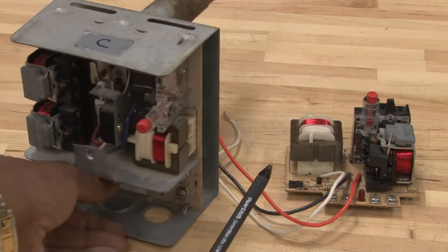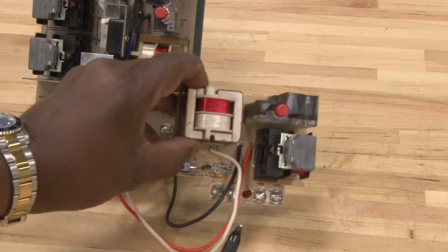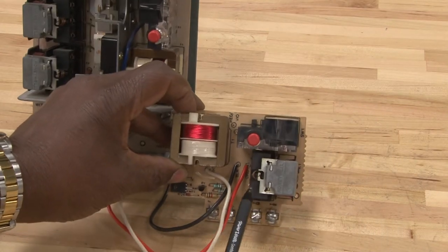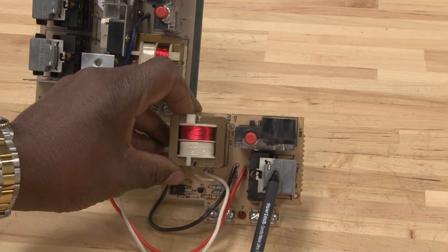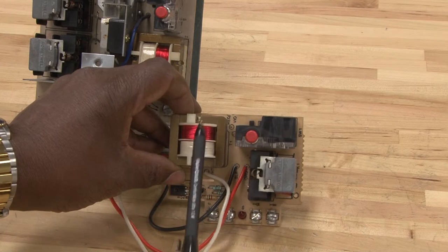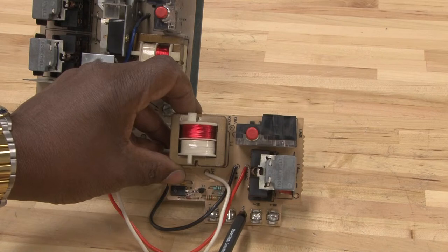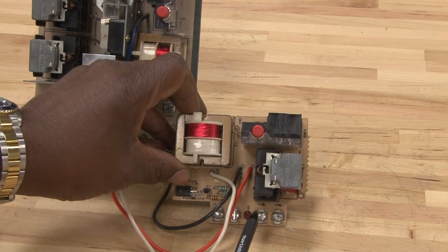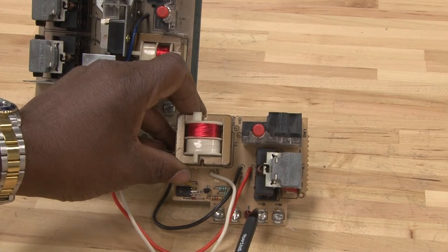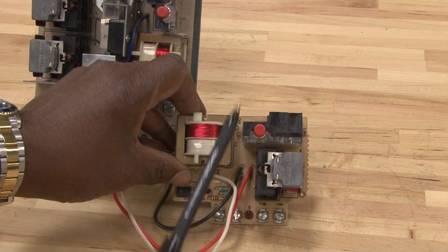The newer type system will use a CAD cell and what we call a primary control. Primary controls using all electronics have some of the similar components such as a relay, overload resettable, and transformer, but also has electronic controls which will sense by time — not by heat — and by sensing actually a picture or the light from the flame. This will react faster than the old stack control.